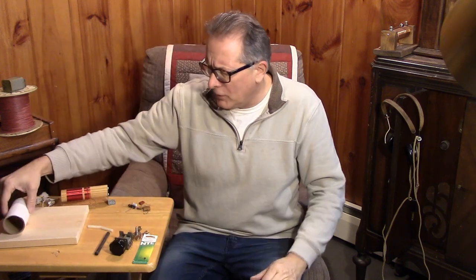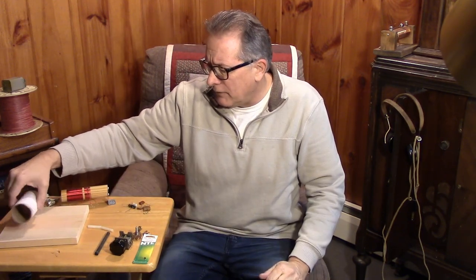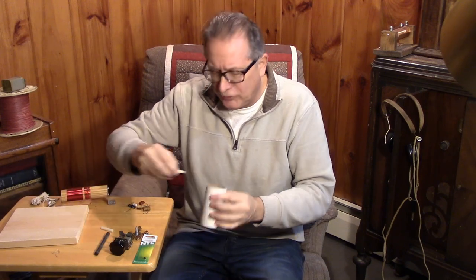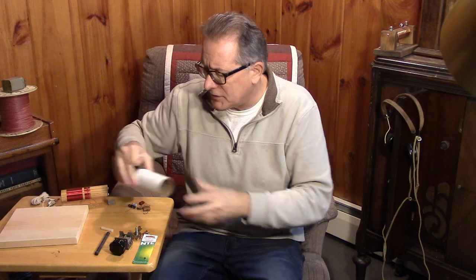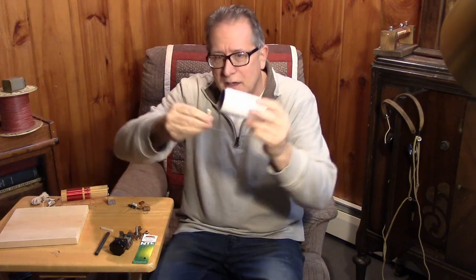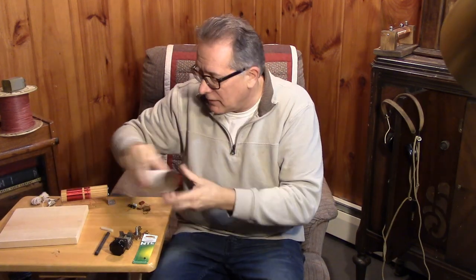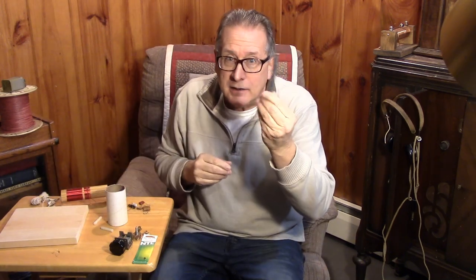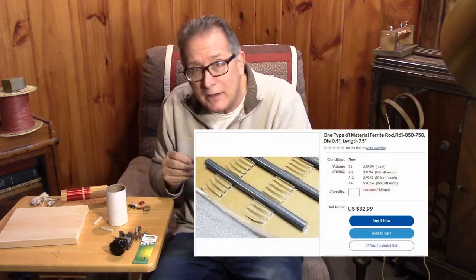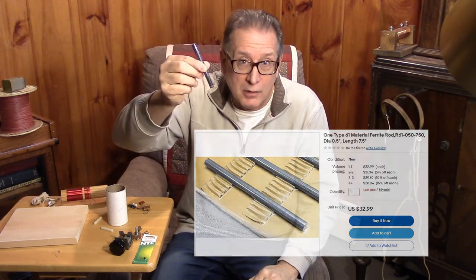Because the wood itself might be taking away from the coil's effectiveness, I will suspend the coil. We can put it up on wood blocks, or maybe use high standoffs to get the coil losses down. And forget it with ferrite — that's just unobtainable. I'm scared of ferrite; I break it all the time. I don't want to build a crystal radio using ferrite.